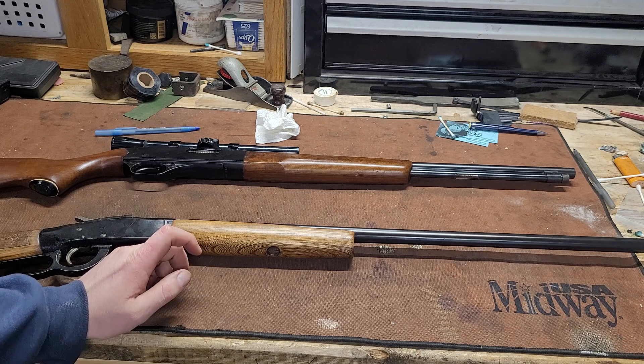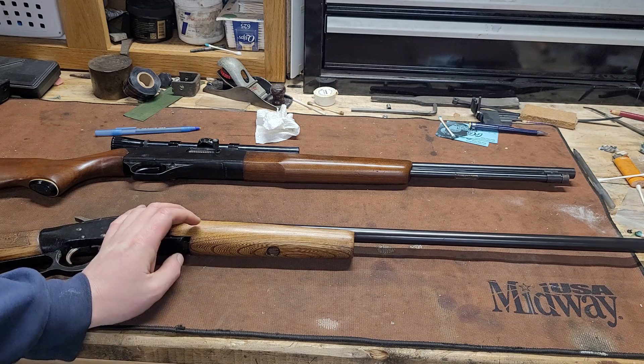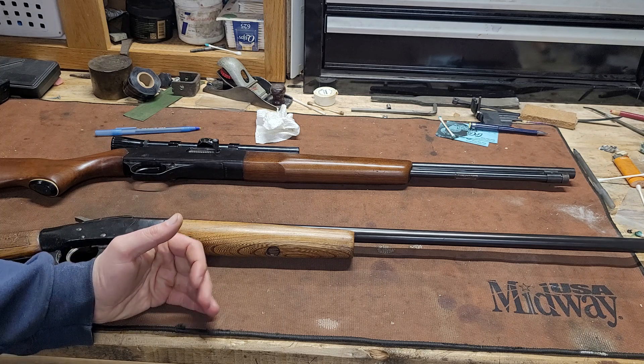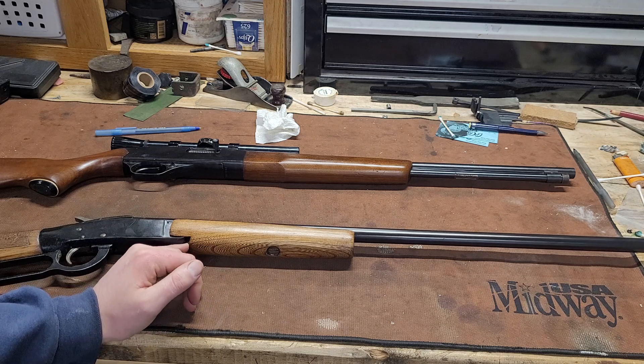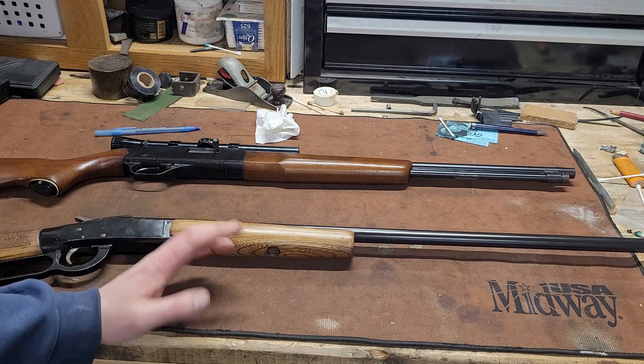I have gone up higher, but I struggle to get everything to rust in a timely manner at a 600-grit finish, so I do try to deter people from that because the price really skyrockets. As for pricing, your average over-under or side-by-side is going to hover around $600, which is really about the going rate. I'm probably going to have to raise prices again because it is slightly more than a day of work. I know a couple of shops that charge about $800 for the same work, but this location won't really absorb that. People definitely hem and haw at hot tank bluing at around $350 to $400 a gun, prep work included.